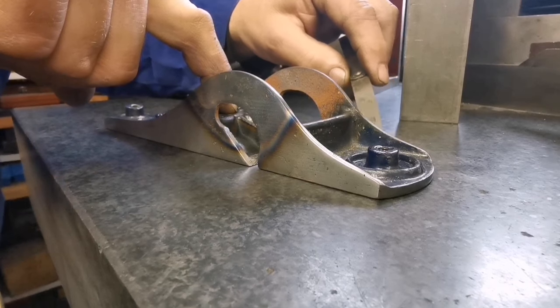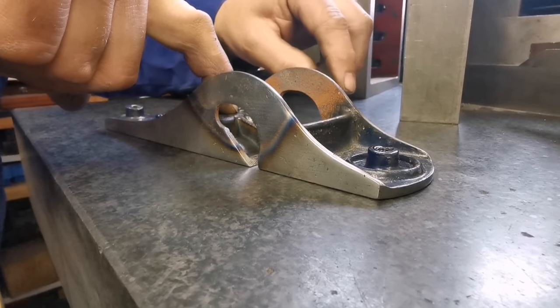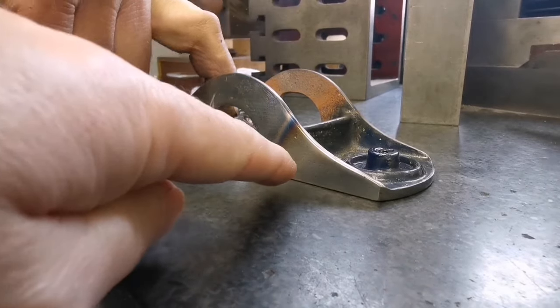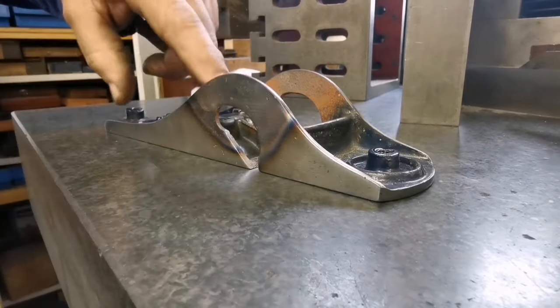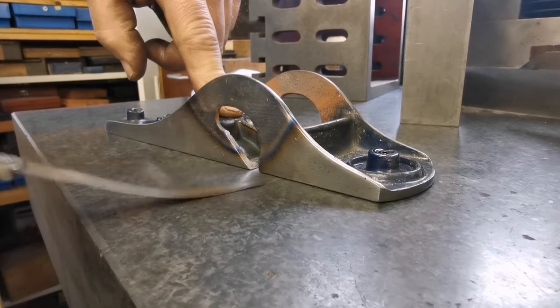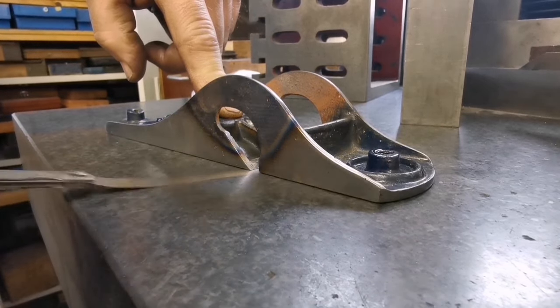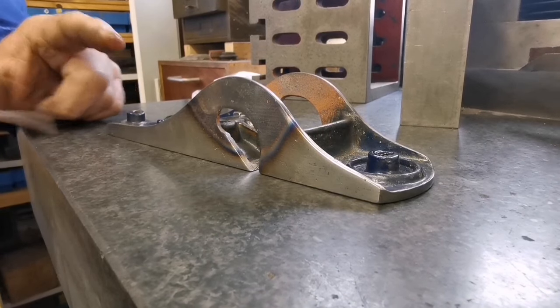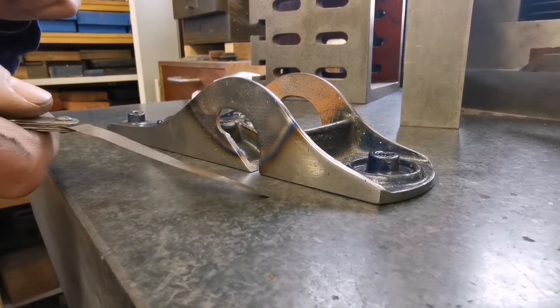I see something's on the plate over there. So right, okay, there's a little bit. So when the spring back, it was this actually lifting as well then? Lifting as well, yeah. Okay. So your plan of putting shims under the back end, yeah, to draw. So what we'll do is we'll pack the back up so the front is standing free.